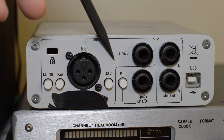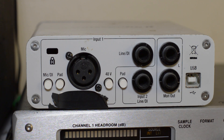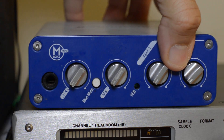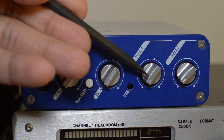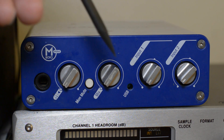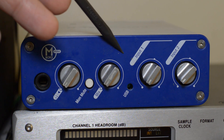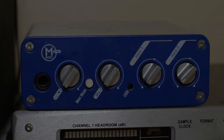Let's turn it around. On the back, you don't have a TOSLINK or SPDIF connection — all you have is your monitor out and your line inputs. If you have an external preamp, you're going to have to hook it up to one of these line inputs. Your next question: can I bypass the preamps? The answer is no — the only way to bypass the preamps is if you had those digital inputs, and you don't. So what you have to do is hook up to that line input, then go to the input of the channel you connected to and make sure it's all the way down. You're going to get the best signal possible that way. I know somebody that has this unit with a Neve clone mic pre and his recordings sound pretty good — of course his room is treated, but that's another conversation.